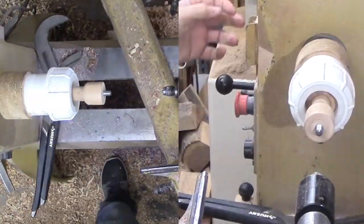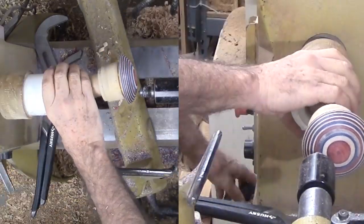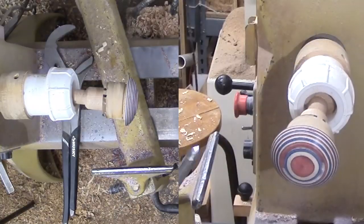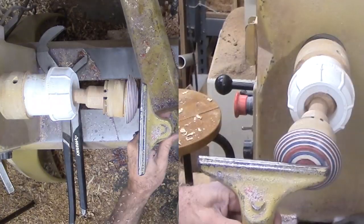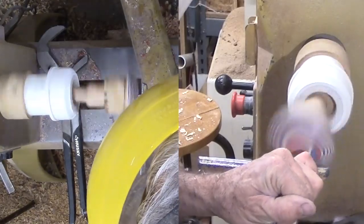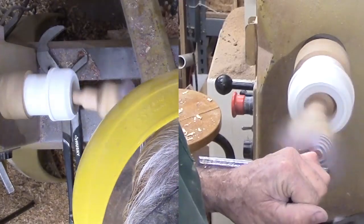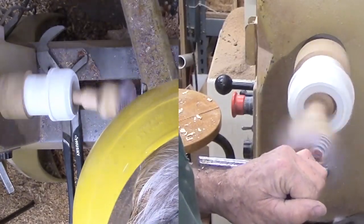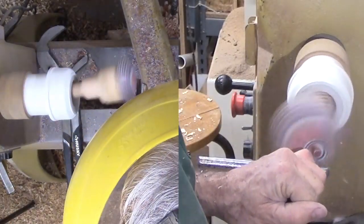Now for the fun part — using the infinite axis chuck. This is a plumbing fitting with a ball joint and a work platform. It is not only off axis, it produces skew axes — turning axes that are not parallel. I use the live center to point to where the feature will be cut. My spindle gouge is freshly sharpened. I am careful to stay on my side of the tool rest. When the lathe is on, I watch for ghosts. They are my friends and are my only guide while the lathe is on.